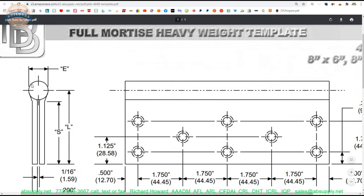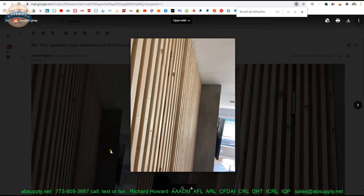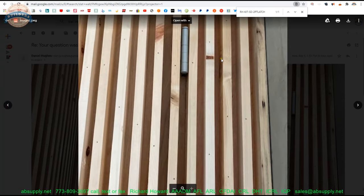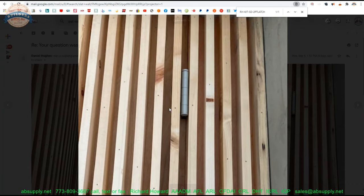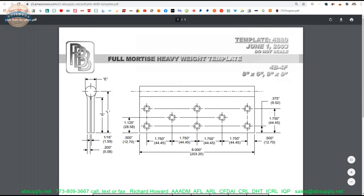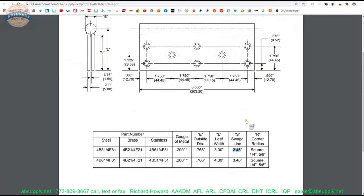Some people ask the diameter of the barrel because they want to know how thick it is so they can build their assembly accordingly. Then, of course, there are the locations of all the holes. This would be considered non-template pattern — meaning there's nothing saying that the PBB hinge leaf location is going to match anything else when it comes to screw holes. So be mindful if you're replacing 8-inch tall hinges: you'll want to check hole locations, because if it's Stanley, Hager, McKinney or others, the hole locations may not line up.